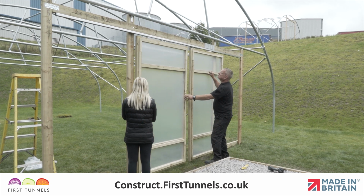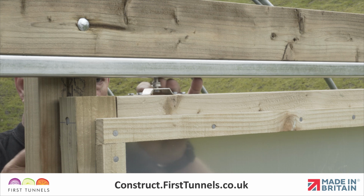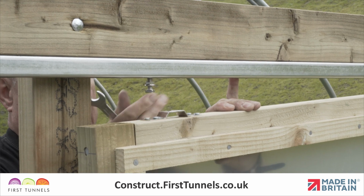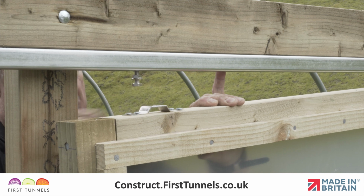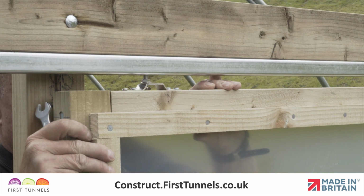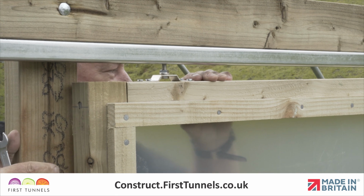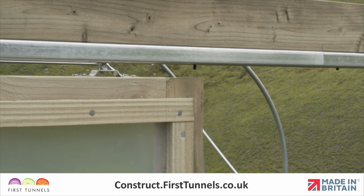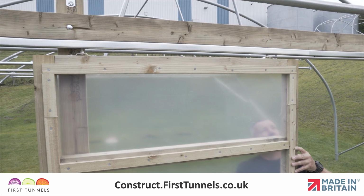Slide the doors to the central position. You may need to adjust the doors to the correct height. You can do this by tightening or loosening the wheel assembly. Adjust each stop by releasing, sliding along, and then retightening until the door stop is in the required position.